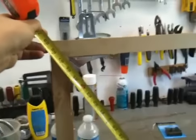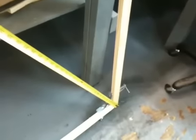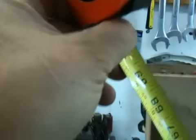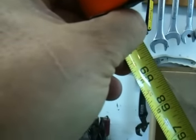I got this assembled, got my clamps on — four corners — got it tacked and glued. And this is how you tell if it's perfectly square: you measure from corner to opposite corner, on both directions. What we got is 68 and 15/16 inches.